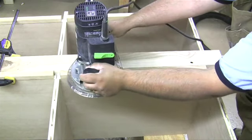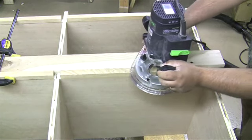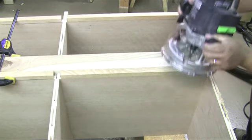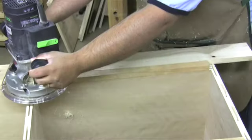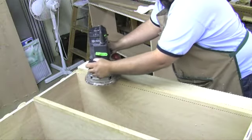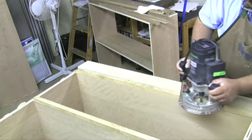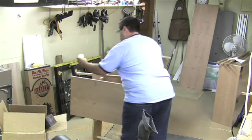It's really important to pay attention to grain direction because this is when you can get some really nasty tear out, and you may find it necessary to do a climbing cut to avoid that. I just take a few little passes, then go back, clean it up, and do another little pass. By taking these little steps I get a really great result — immediately I notice it is absolutely flush. I finished up the rest of the horizontal face frame, sped up for time's sake. The most important thing: take your time with this. It's better to spend a little extra time to get the result you want than to come back and sand all those tear outs.